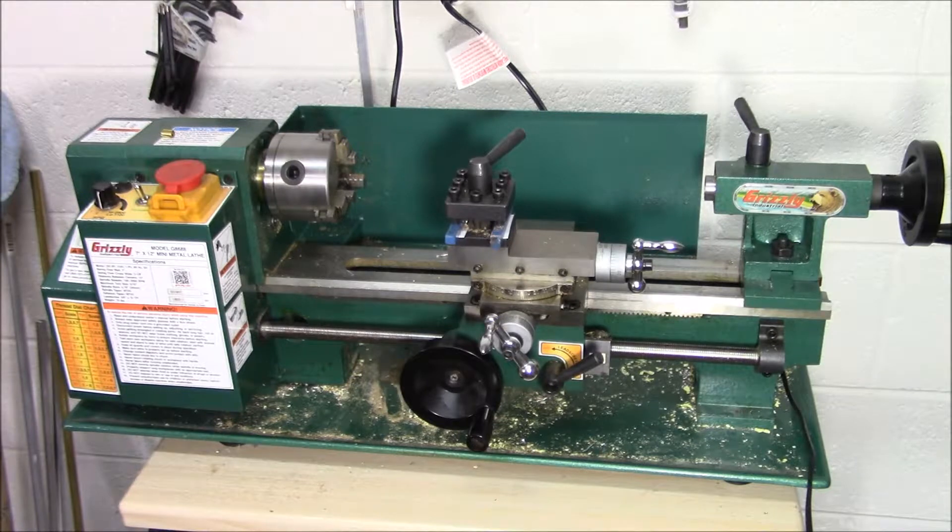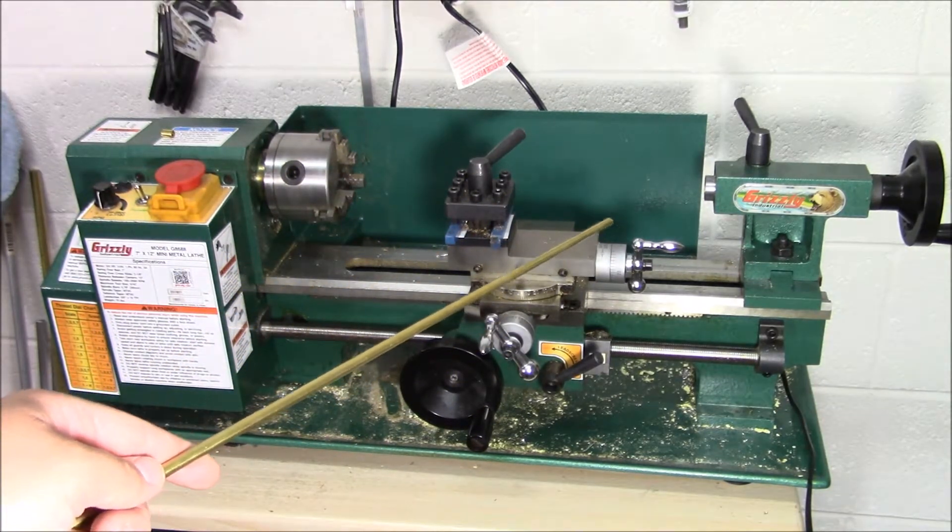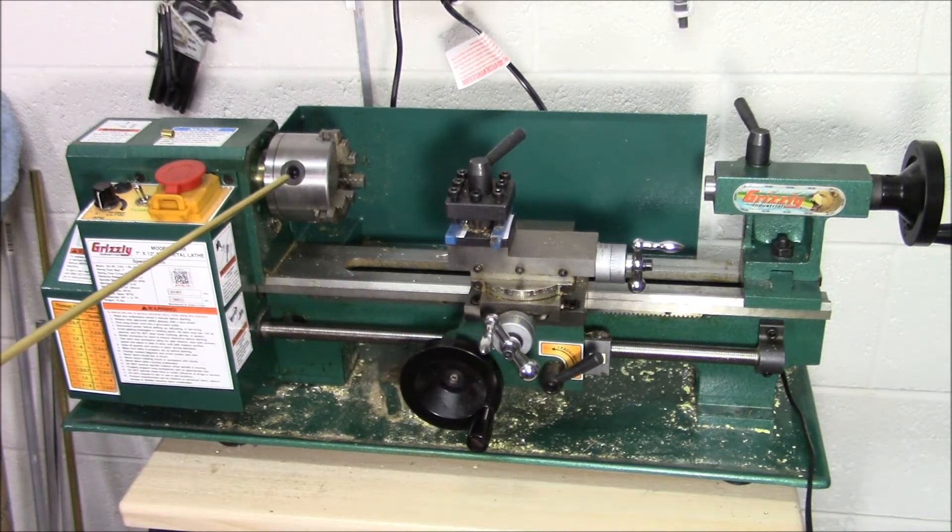You can't really do that on a 4x6 lathe because you'd be exceeding the usable space. Generally, the majority of work on a lathe is done from the headstock to about three-quarters of the bed — you usually aren't turning a whole piece. A wood turning lathe is different and doesn't really work for model making unless you're only planning to turn wood or styrene. You can turn styrene on a wood lathe as well as on this lathe, since it spins slow enough. But of course you can't do metal on a wood lathe, and a wood lathe isn't as precise as a metal lathe.